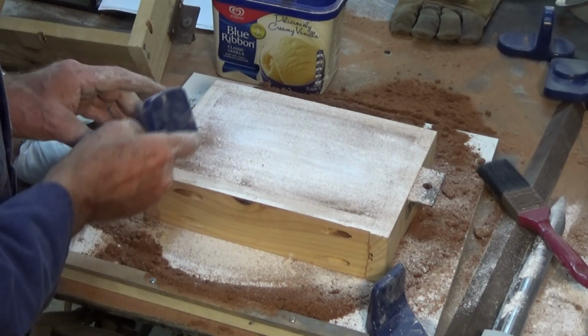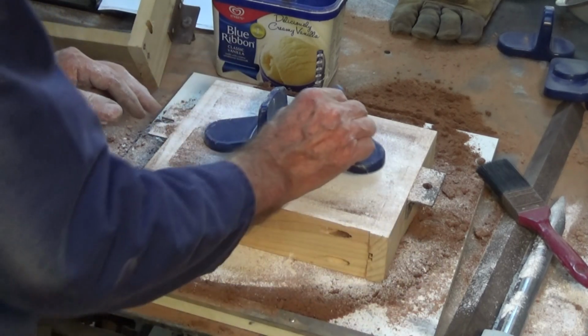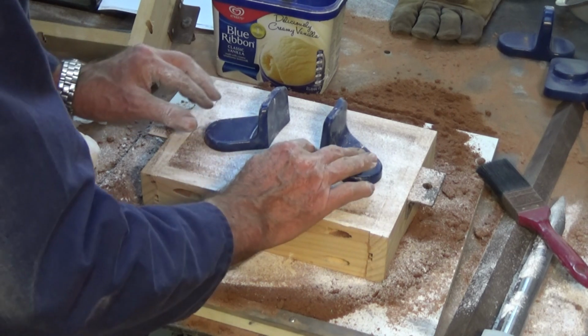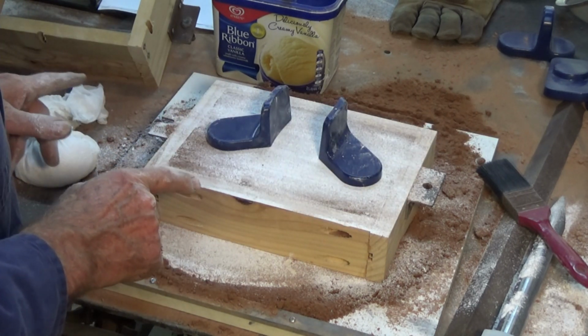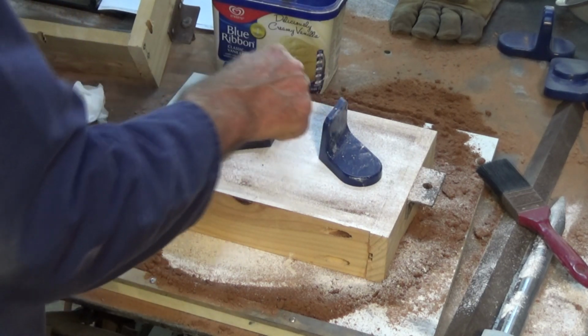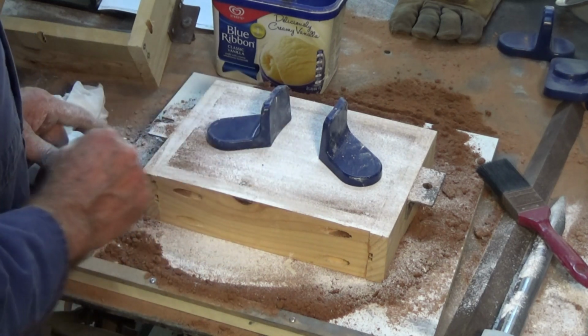So this is what I'm thinking for this first set of castings. Now, this is a left and a right hand pair, and I'm thinking they're going to go diametrically opposed like that, and we're going to have a large riser in between the two patterns. We'll have the sprue out here and then we'll have a runner going between the two.